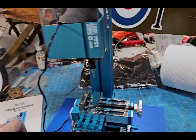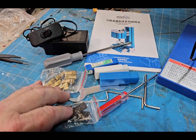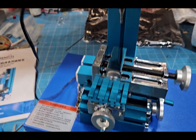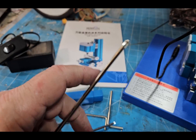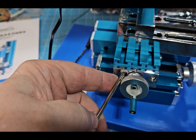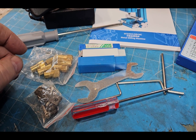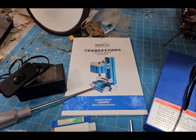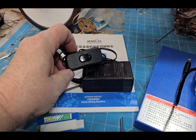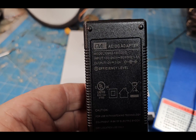You're going to get a very honest opinion from a journeyman-level machinist. It came with a few extra tools: some collets, hold-downs to mount it to its base, a couple of screwdrivers — though the tip is a little too pointy, so I need to take a bit off so we don't strip out the Phillips head screws. It came with three end mills, but no real tiny end mills, which could be a problem. Of course there's the operator's manual.